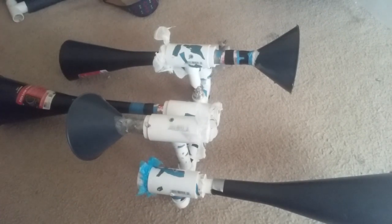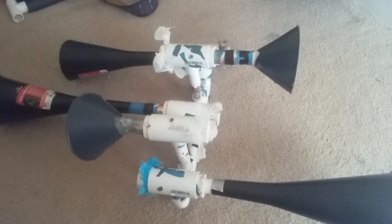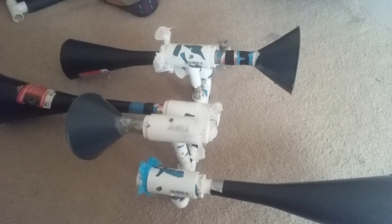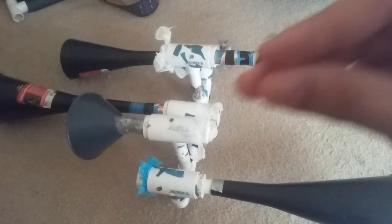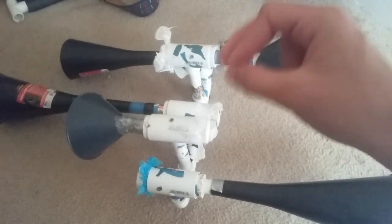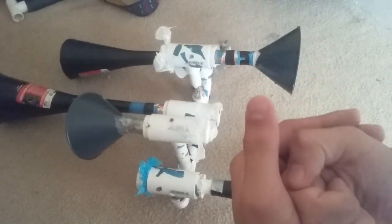Now, why it sounds like crap now: being on a solenoid valve for so long, not restricted, pounding the diaphragms, will make it sound like what it sounds like now. I'll leave a link in the description labeled as number two. As for other locomotives such as the SD40Es, that is just from being put on a solenoid valve but not at as high an air pressure, so it still has some of the bells sounding but it's still hitting the diaphragms quite hard.